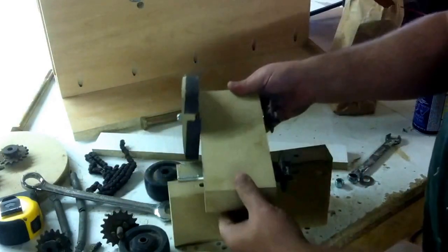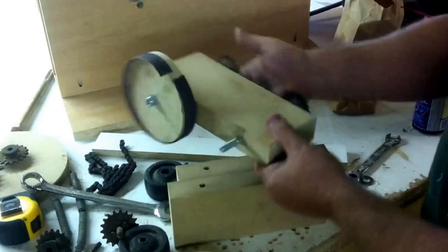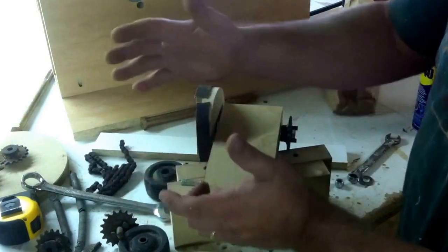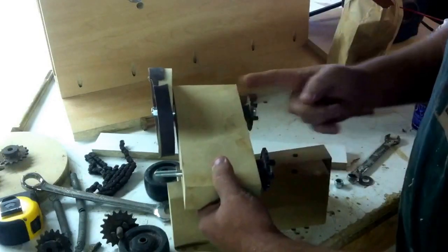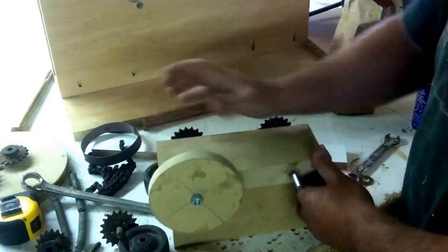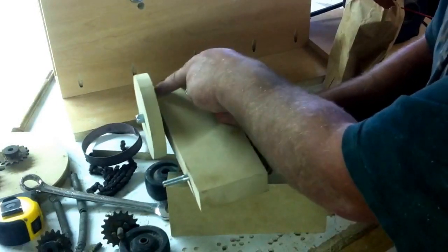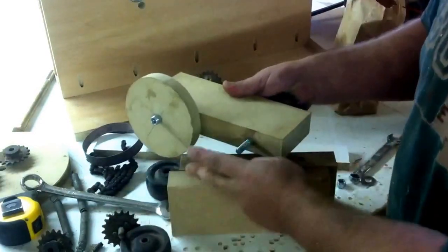Now the part that I did — as you can see here, it's wider at the back than it is at the front, and there's a reason for that. It's because when this thing is used as a fence, these little wheels actually have to be tipped toward the fence in order to make the material pull tight. Like a car — if it's out of alignment, it's always going to want to pull toward the ditch. Same thing here. By just taking a little bit off this side, the shafts run straight through to keep my chains nice and straight, and then I just narrowed this up. When I mount this to a fence, it's always going to have the material pushing toward the fence. So the material is going to be running through on these wheels — it's a lot closer at the front than it is at the back. This one's spaced out so it's going to cause it to always track toward the fence, which is what we want. We don't want to have to push it in — we want it to do it itself.